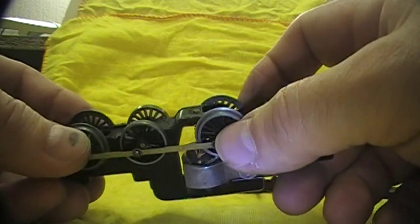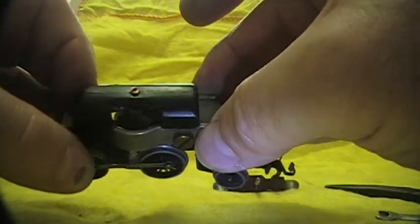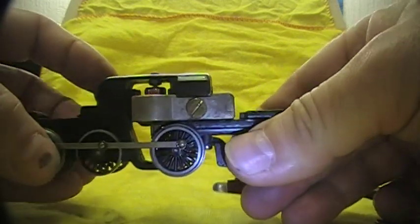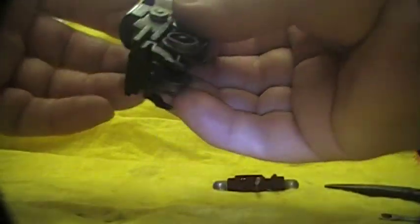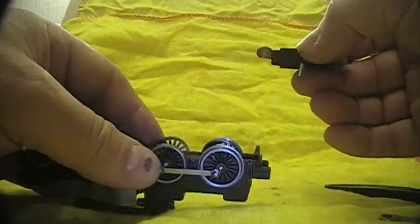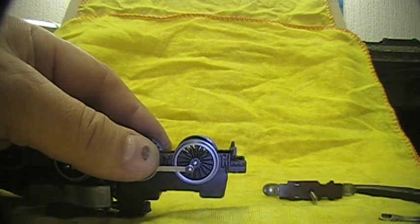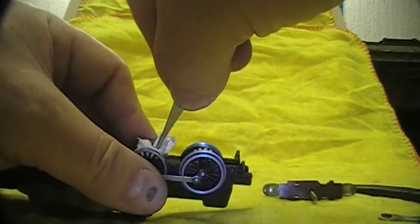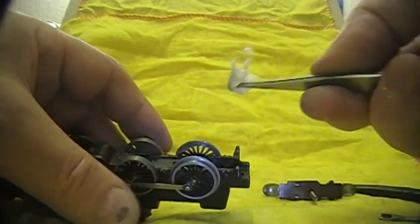You can also check all the wheels are free. I don't advise taking the magnet unit off because it'll lose some of its magnetic strength and therefore weaken the whole unit. Now we'll put this back together. It's already been lubed, but it is a good opportunity to clean inside — you can use a pair of tweezers and a piece of paper. This was recently cleaned and lubed, so I'll just give it a little clean around and a couple of drops of oil just inside.